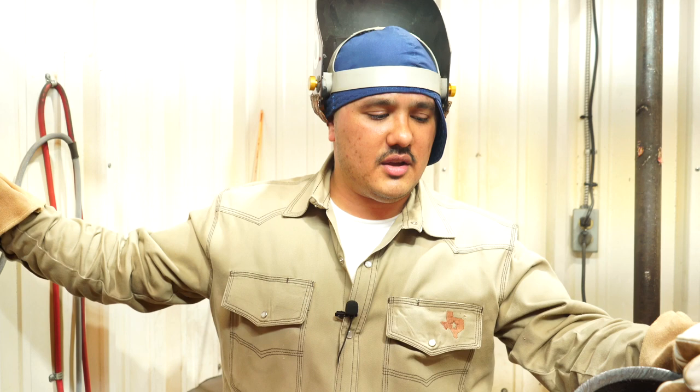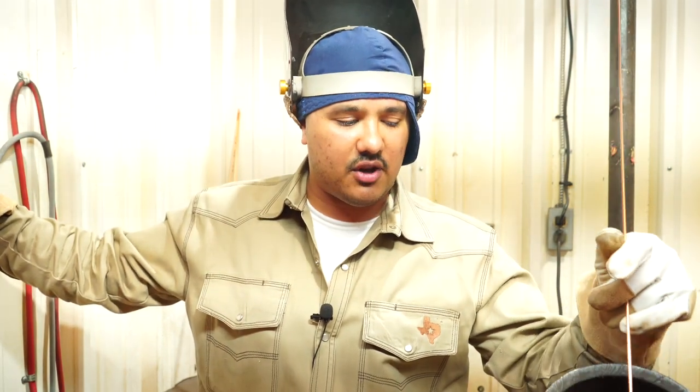There's a lot of different ways to do this. You know, there's a beginner way, and then there's a faster way to run it. Hotter, more metal, the way a lot of these guys run it out there in the field, but that comes with experience. If you're starting off, be careful with that hot pass. Do not weld too hot. If you feel like you're not melting that wire properly, turn it up just 5. I see a lot of these guys, they see videos on YouTube, and they come in here and they try to fill it up from the root all the way flush. Hey man, you're starting off. Take baby steps at a time. As you're getting better, we'll turn it up hotter, okay?